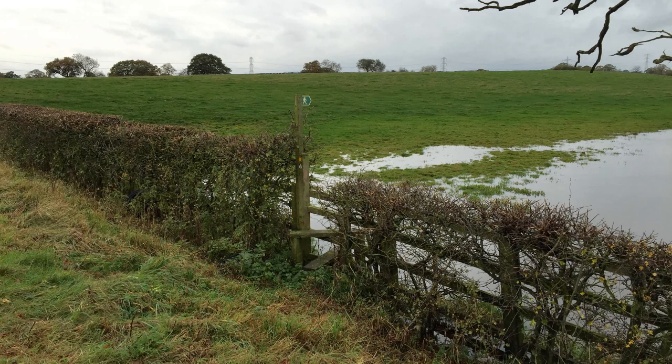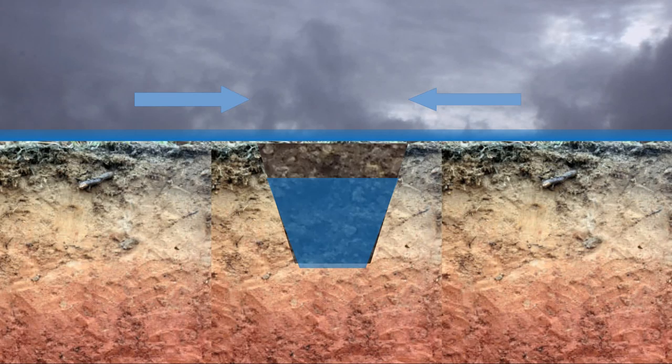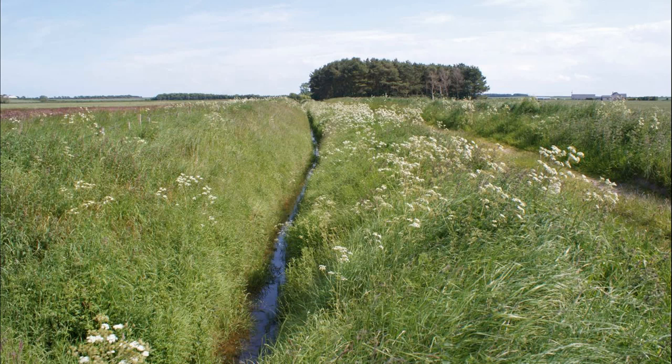For the most difficult drainage areas — where you have standing water or puddles for a good portion of the year — I can't think of anything better than a French drain. Remember, if you dig a hole and place coarser material in it, it collects water from the surrounding area. If you do the same with a trench, fill it with coarse material, and have a pipe at the bottom, that is a French drain — and you can redirect water away from troubled areas into a lake, pond, or another drainage area. For best aesthetic effect you'd use gravel, or you can simply use an open ditch to carry the water away.